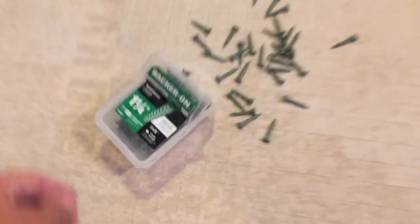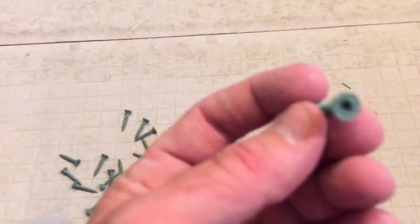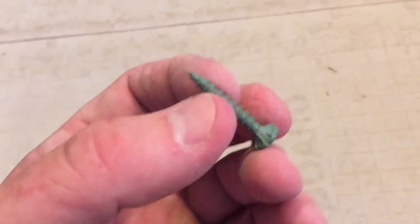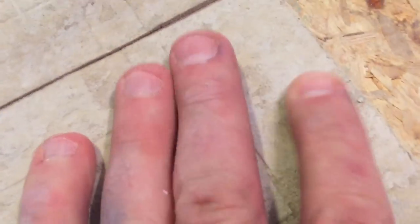As you can see, there's one, two, three — and then they go through the middle, there'll be little circle spots. There are like 50 or 54 I think in these. I'm using inch and a quarter screws, this is really good subfloor. These screws come with their own bit and they really bite in — I've countersunk a couple of them right here.